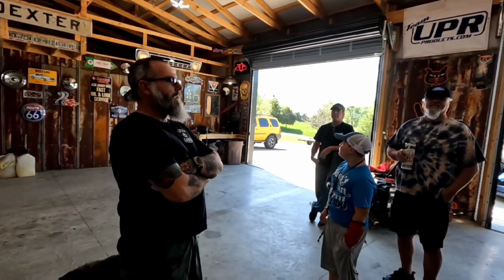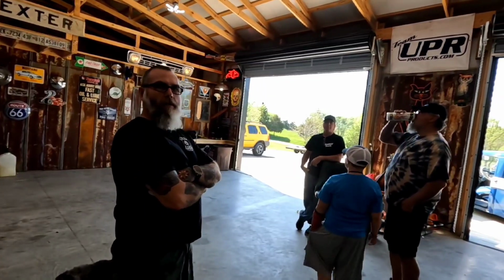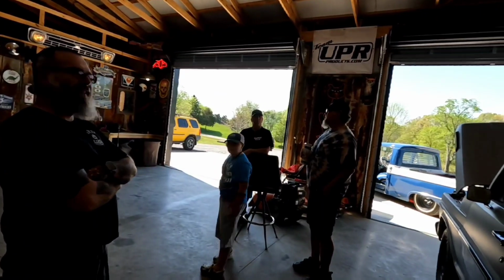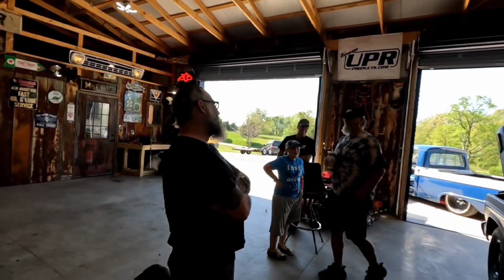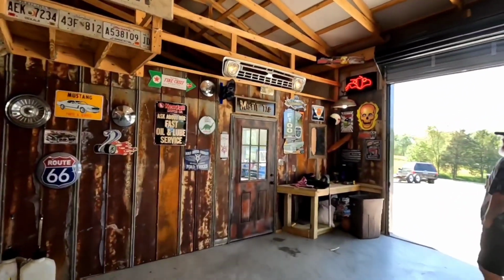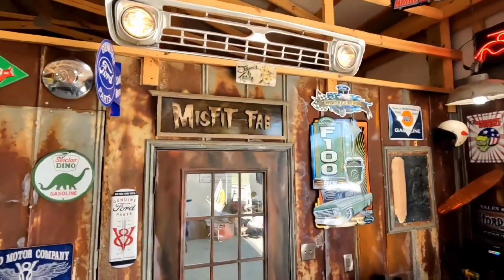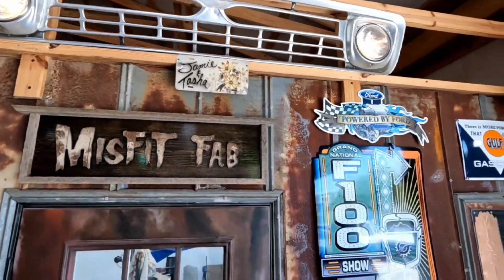So if you're doing multiple passes, I guess you're cranking down a little at a time to get that form. Because I know Gerald went on one piece and cranked down a little more than he should have, and it came out a little wavy. Well, it depends on what you're doing. If you're just making something for looks, a light bead is all you really need. If you're making something for strength, then you're going to make a deeper bead. Want to go pretty deep on it.